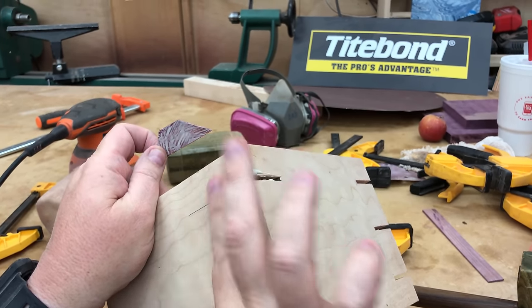There is one difference here: I'm going to put a stop block on both sides of this. The dovetail cutter is just a little more violent than cutting a kerf with the table saw, so I'd like to have the box in there nice and secure so it doesn't bounce around or move at all. I'll make sure it's snug but has a good fit as well. We did do a few test cuts checking various heights of the dovetail cutter until we found a height that we thought was pleasing, and then we cut the box after that. You don't want the dovetail cutter to be so high that it appears on the inside of the box, so you want it somewhere short of that.